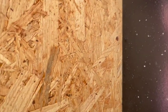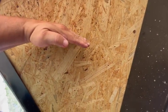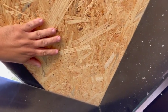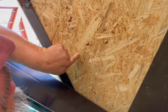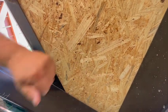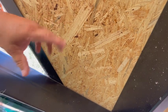All right guys, I know this is hard to see, but this is the nose part of the trailer. See how it goes, a triangle? So I got a nice wide opening right here. About halfway right here, I've got my shower this way from this half. So right now I've got to measure the thickness of my wall, which is probably the thickness of this beam right here, but I'm going to add probably a couple of inches. I'm going to drill my hole over on this side, and then from the top I'm going to draw a circle from the hole, and I'm going to come back. So my exhaust is going to come out right here, the hot air. It's not extremely hot, it won't burn, it's just hot air from the inside from the AC unit.